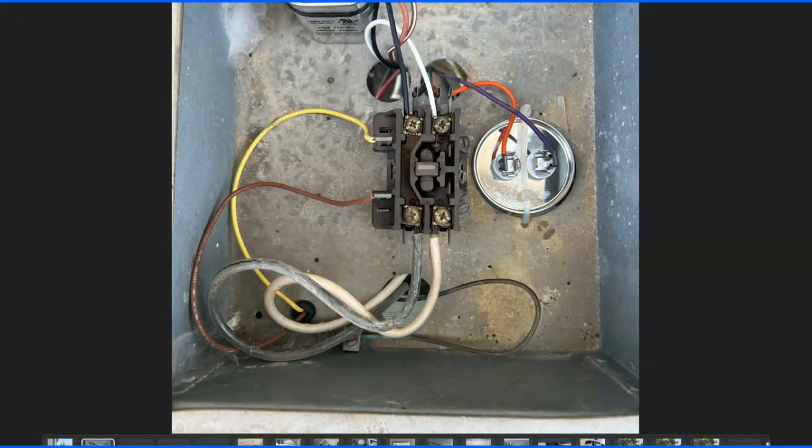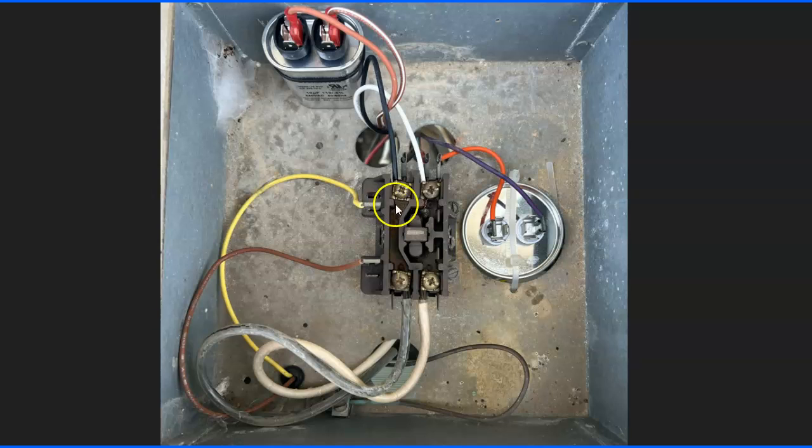So this is my new wiring after I cut off the excessive wiring and moved the protective wiring straight up to the copper — you notice there's no copper exposed here. This is also where I changed my capacitor. The tip I was told is: even though your old capacitor is working, a bad capacitor can make your motor go bad. So maybe it was the capacitor that made the engine go bad. If you get a new engine, you probably ought to put in a new capacitor. The advice I got — which is pretty reasonable — put your new one in there so you know if the other one was bad, it's not going to burn out this motor or your compressor. Keep the old one as a backup. That made sense to me, so I changed it.